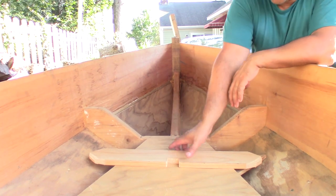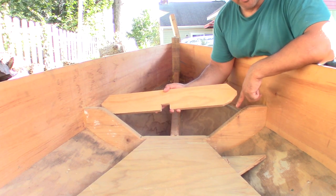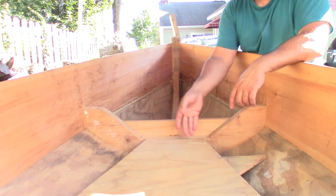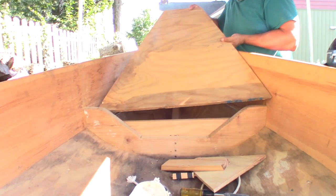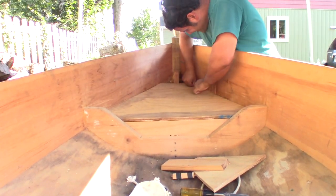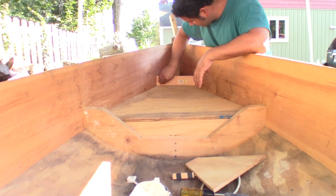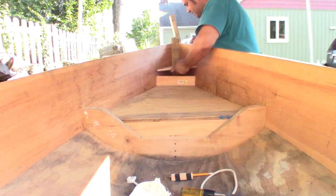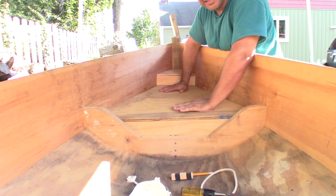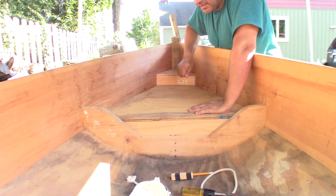Here's where we are. What happened off camera is I made this piece of wood to go here. I made a mistake and meant to only bevel the bottom corners, but I accidentally did the top corners too — that's not going to mess us up, it won't matter. That piece closes off that end. Our main triangular piece goes here to close this off. Then we have another closure piece and our final piece at the top, which will close up the bow and give me a place to store things. More importantly, it'll allow me to have about two cubic feet of foam inside this space.